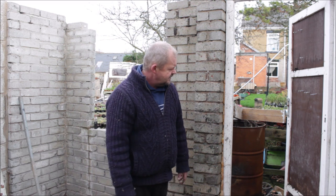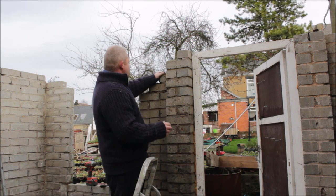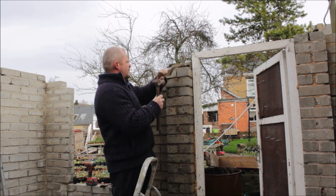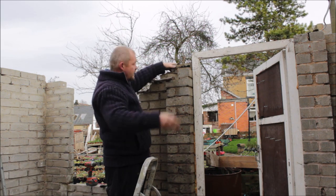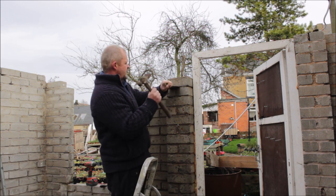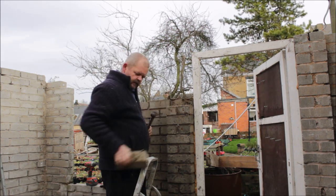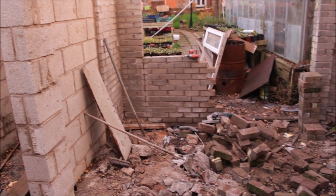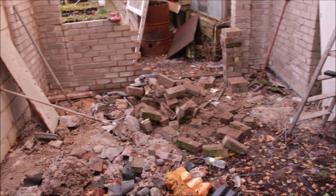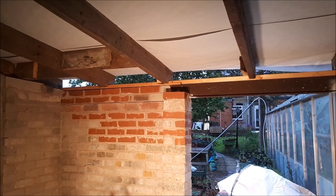Although I ain't got much mojo today, we'll keep trucking on. So I want to let this door open. I've got the wall down and the endless task of cleaning the bricks up so I could re-lay them. And I forgot to film when I did all the brickwork, so I've only got the image of when the roof was on. I've got the wall plate sat on the wall, and I've put an RSJ across the door — that should give plenty of support.